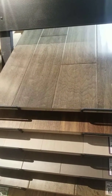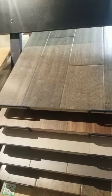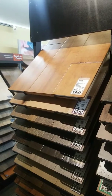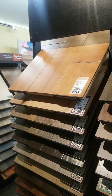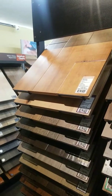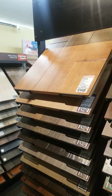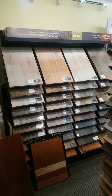The downfall with wood is wet areas — through kitchens and bathrooms. Although we do install it there, I always tell people water and wood do not mix. Often times they still choose to do it because it looks congruent throughout their entire house and looks really good. The other downfall is if you have a lot of kids or wear high heels often — it's probably not a good idea to do wood, mostly because it is only scratch resistant. People who are particular will notice the difference in resistance between this and a laminate or a different product.